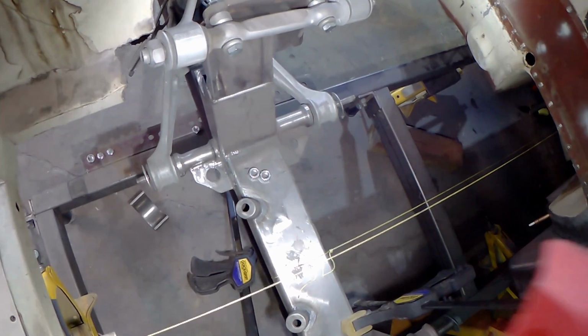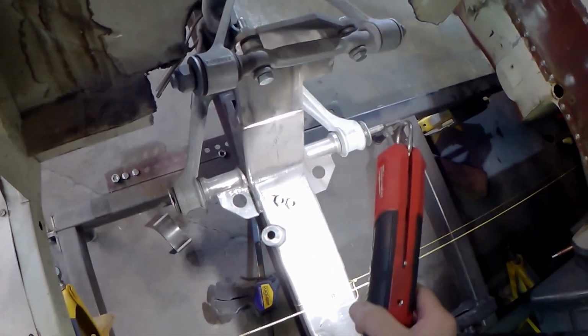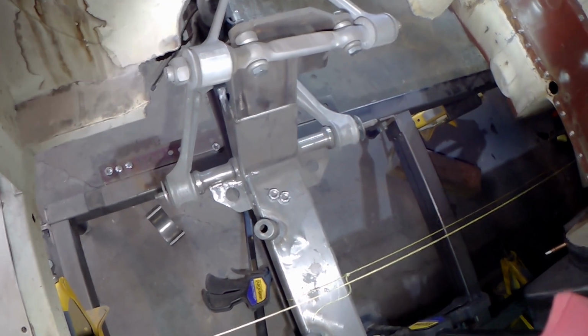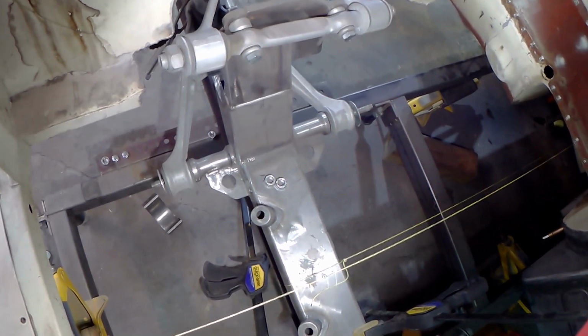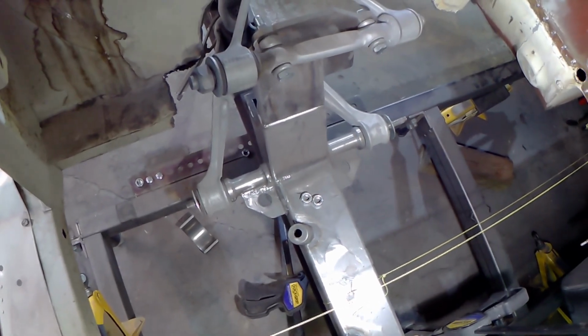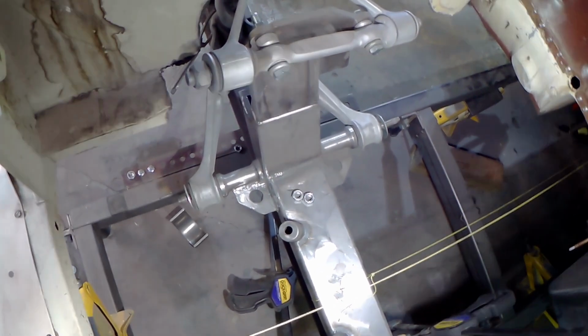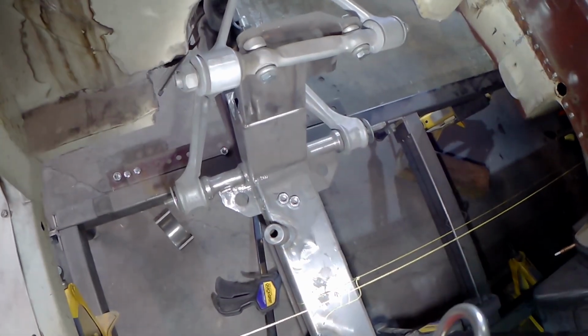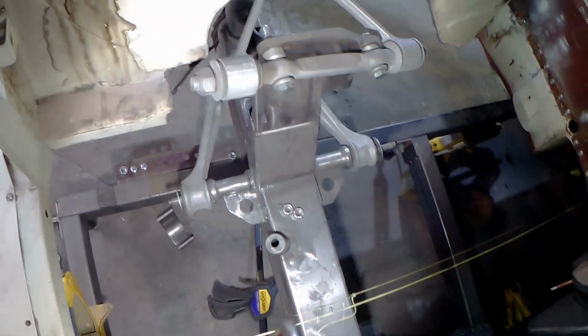It's got a nicely machined piece at the front. It's just unfortunate that these lines on the front are off ever so slightly. Now, they're weldments, right? You do what you can. I understand. I weld. So I was just hoping for a bit better. So I'll have to put both the front and the back of that lower control arm in double shear. It does come with these monster thin washers. These things here, I'll take you underneath and show you.